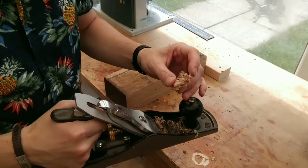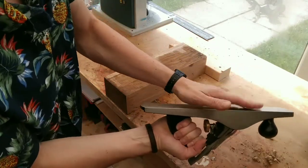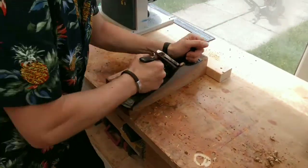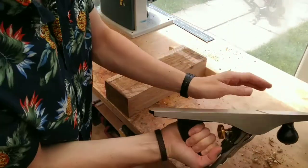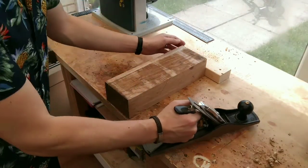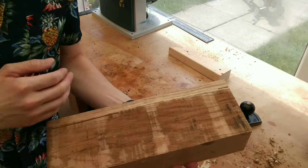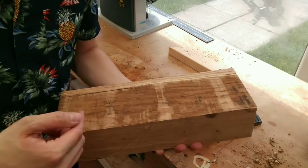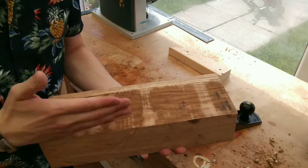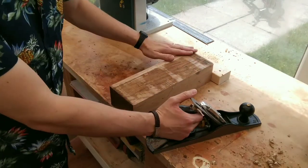What you want to see is some wide thin wisps of wood like that. If you can hear it juddering, that means it's wavy up and down. You can see on the wood where it's shaved, missed a bit, shaved, missed a bit — that's because the wood is raised in certain places and slightly dipped in others. The plane is shaving down the higher spots and working its way down to make it nice and level.